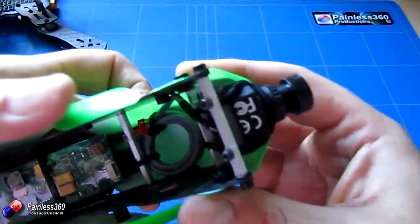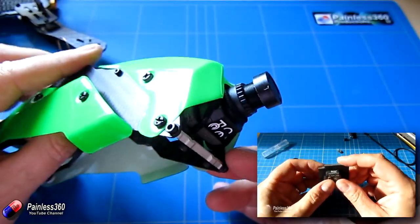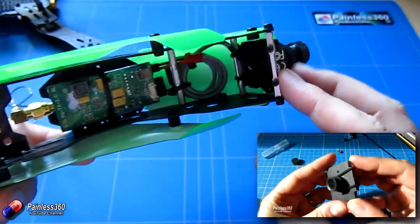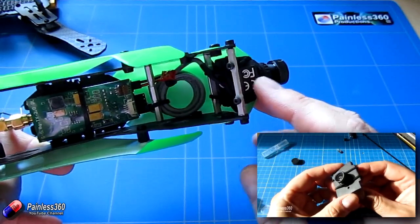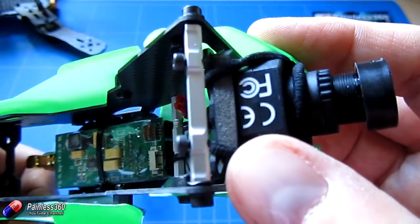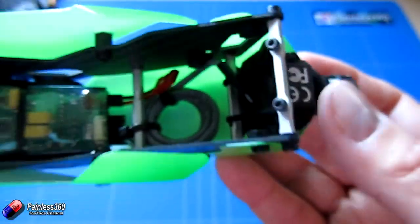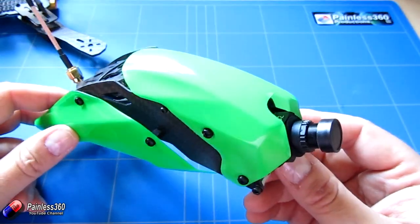For mounting the camera I've used my classic method — I'll put a link in the description. It's a bit of black foam board with the 700TVL Fat Shark camera mounted on top, which lets me get the cable out of the middle of the back of the card since it comes out the side. I've mounted the camera on top of the foam so the cable can exit from the middle, and there's a hair band wrapped around the whole thing going around the actual frame too.